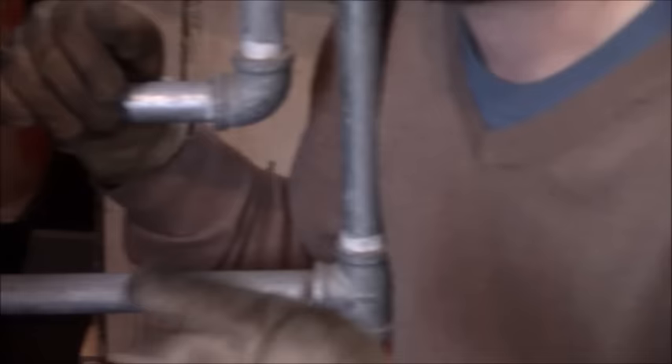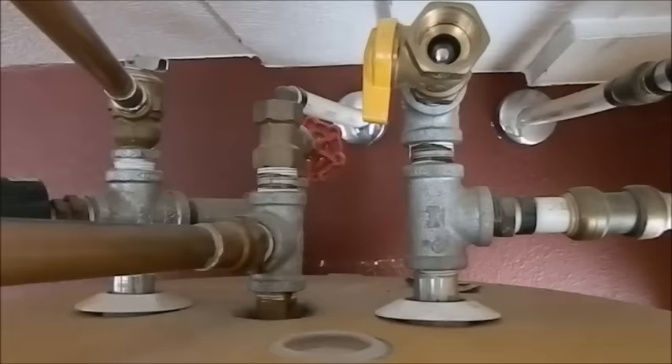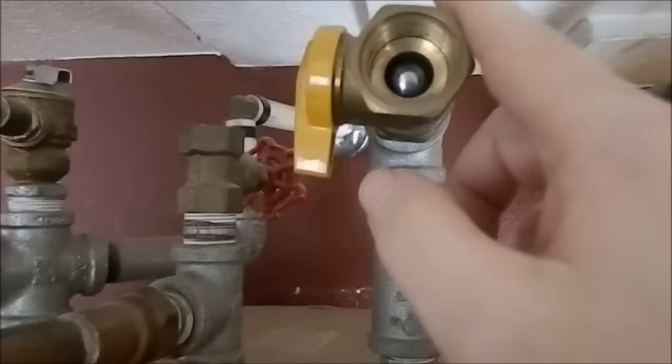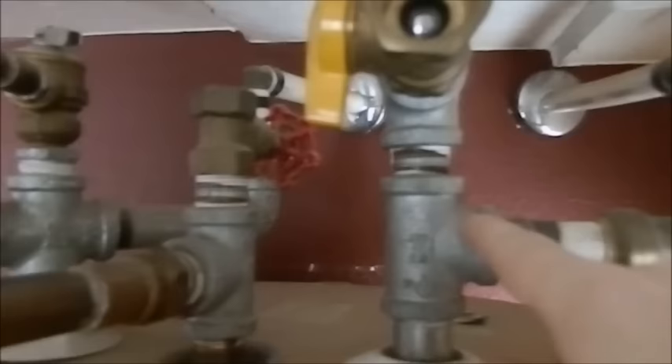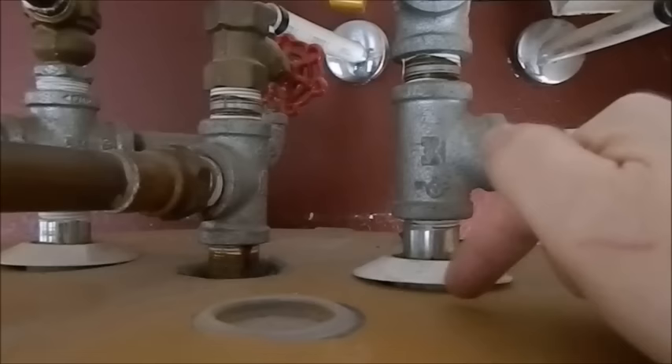Looking at the top of the water tank where I store hot water, I'll show how all the pipes run. The cold water comes in from the main house line to a T fitting — this could actually be an elbow; the shutoff valve here was planned for a future solar water heater. The cold water pipe travels all the way to the very bottom of the tank so that cold water travels through the warm or hot water surrounding it before reaching the drain valve.